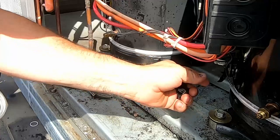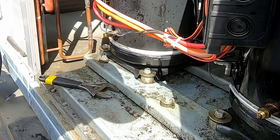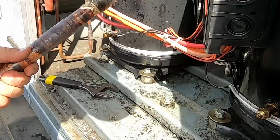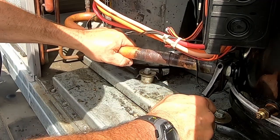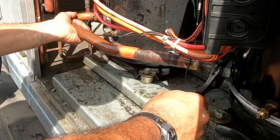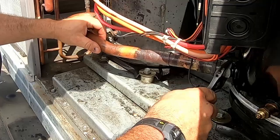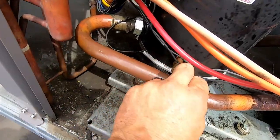Taking off the tape we put back on. Got our rings back on there - a little bit of the oil we had left over on that fitting to get it to turn, and a little on that ring. I'm sure these have a torque wrench setting but it wasn't in the instructions. We're using an 8-inch wrench here so we're not going to overdo it to the point of causing an issue later. That right there looks pretty good.